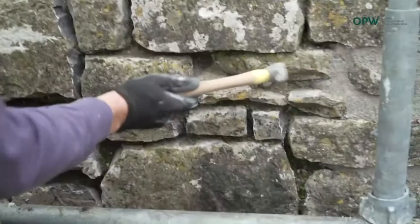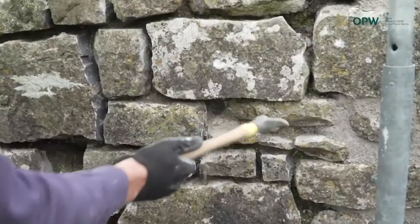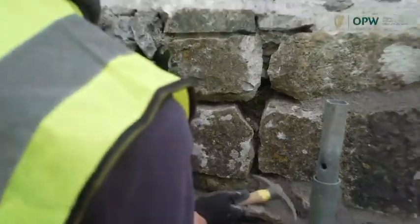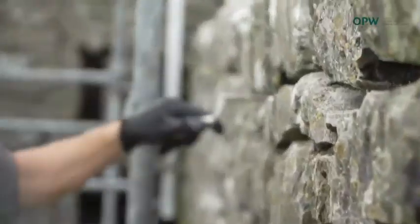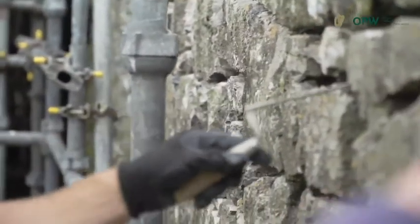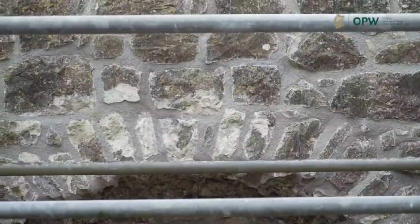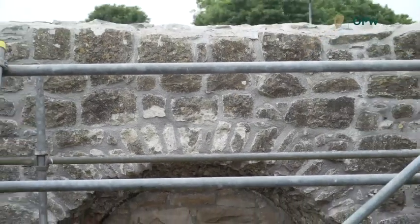When we first take out the mortar, we bring samples back to the depot in Athenry, and Rob back there then analyses what's in the mortar. We source the material locally, like sand and lime, to mix it back and repoint it, so we can have it as close as possible to what was in it before. We use lime mortar to repoint it all, to have it look aesthetically the same as it was when it was first done years and years ago, when the wall was built.